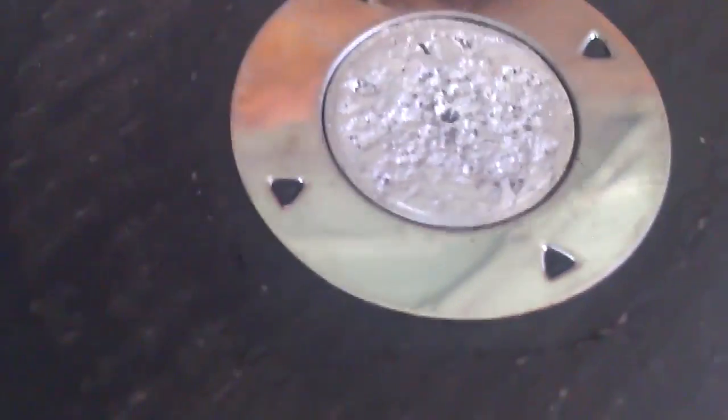The metal part on the disc is actually chamfered, so that's why it looks like there's such a gap there. But if I grab this and pull it over to one side, you can see that it is moving, but it's only about 2 thou or so play, 2 or 3 thou. So that's it for the actual spindle part.